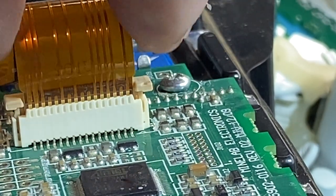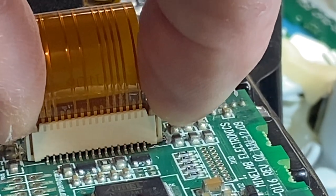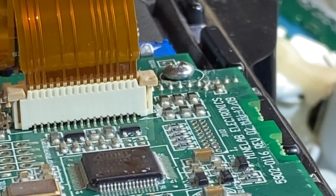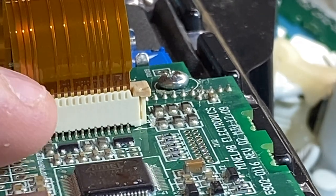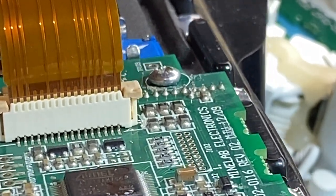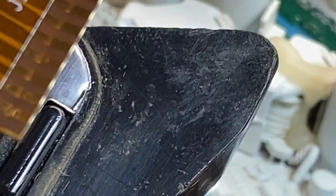lightly push down, and at the same time, slide onto those tabs with your fingers and push. So, yeah, you'd be hard pushed soldering a wire on the top there. You could do it, but it'd be too much interference with the plastic. So go for the bottom pins. So that's how you fix mylar strips out in the bush when they fail. And it is damn common.